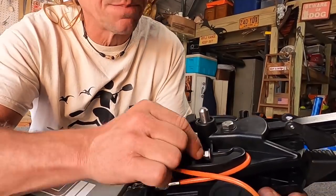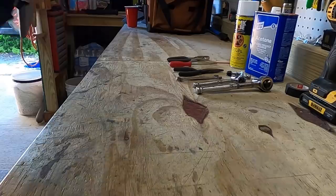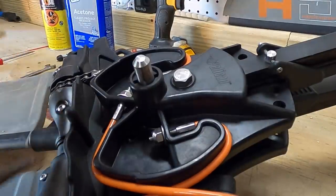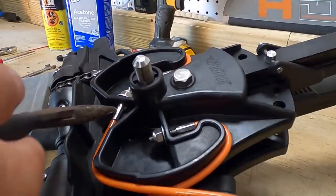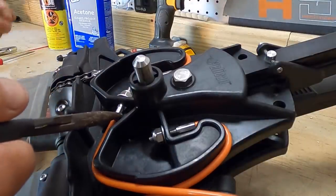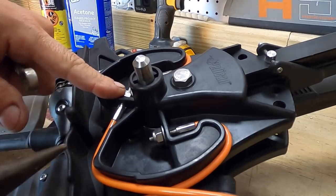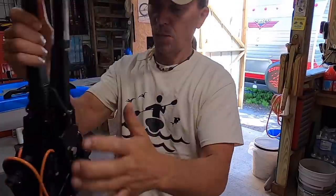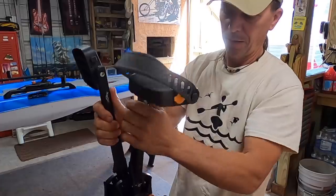When you get these things from the factory, one of the things you might want to do is loosen up these cables — the little retaining nuts that hold them down. They're a little stiff right out of the box. All you really need for that is a pair of needle nose pliers, because regular pliers might have a hard time gripping some of these cables. Grip that, use a 7/16 open-end wrench and loosen them up just a little bit, about a quarter turn each. There are three on this side, three on the other side, and you'll find that this will be a lot looser.